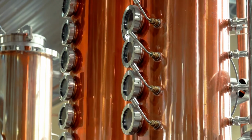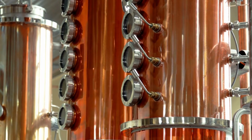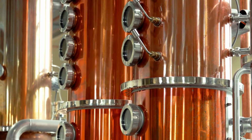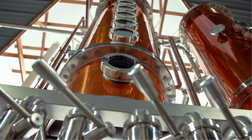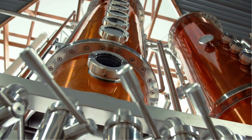The most common refining method is triple distillation, in which the temperature of the liquid mercury is carefully raised until the impurities either evaporate or the mercury itself evaporates, leaving the impurities behind. This distillation process is performed 3 times with the purity increasing each time.